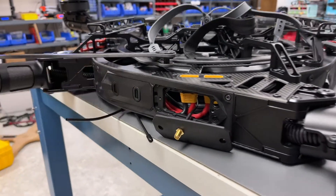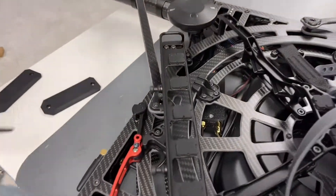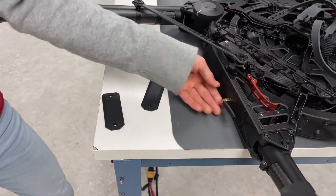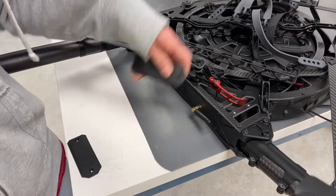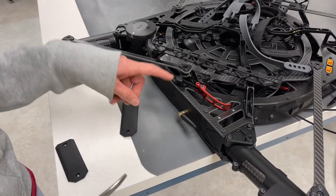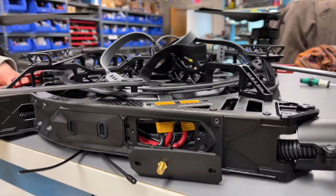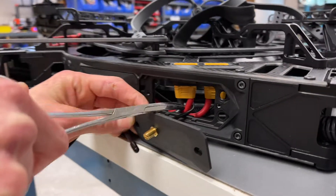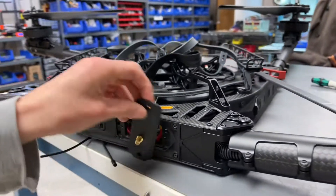Another little trick here is your SMA connectors. This one is actually in the back left of the drone. This is how you're going to push the RFD through. You'll just take off the panel that comes on the drone, put your RFD in, and then you can replace it with one of these SMA panels. This one's a little bit trickier — you want to run the SMA cable between these two power wires, so just make sure you do that.